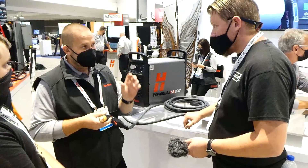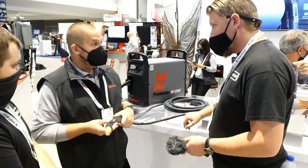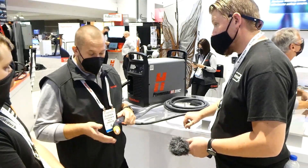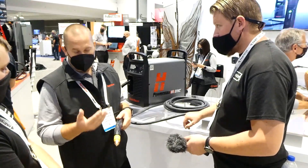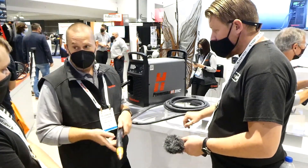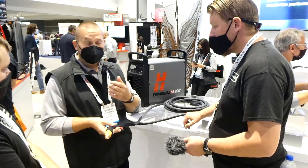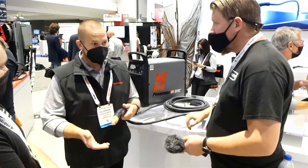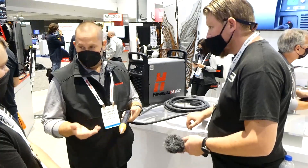They have sent us documented data, and we're actually marketing up to two times' life with the cartridge for hand-cutting. The cartridge is less susceptible to all those operator variables — somebody cutting too fast or too slow, variations in speed, variations in standoff height — the cartridge withstands that better. And honestly, some of that may be perceptive for customers because they're not wasting time looking for parts or blowing out a nozzle because they put it on at the wrong amperage.